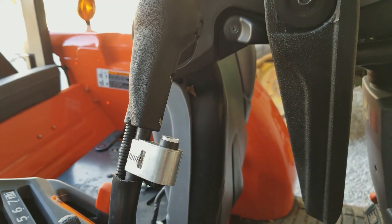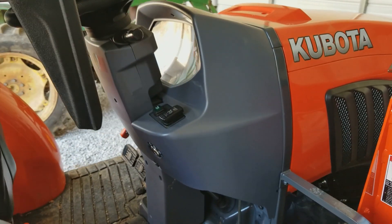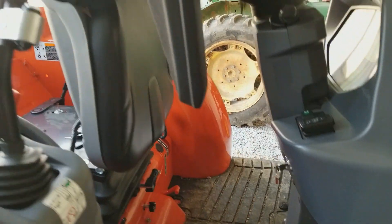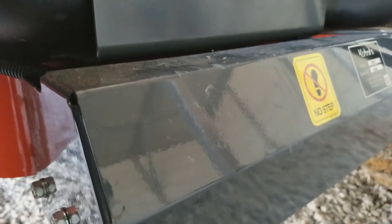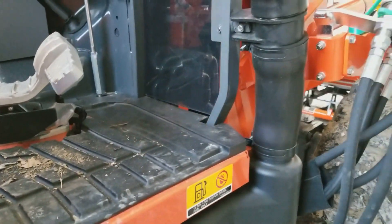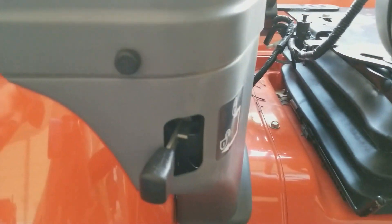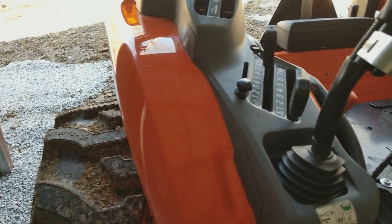Coming up to the control lever, there's one button - when you turn the tractor on and press it, it turns green, energizing the 12 volts going to it. Green means I have power and can use the third function. There's also a thumb switch up top to control it. You should be able to hear the relay clicking. The other clicking in the background is the fuel pump, but those relays are what actually control the solenoid. When I got mine, the relays didn't work, so I had to start investigating.